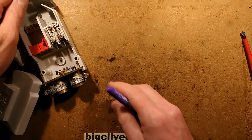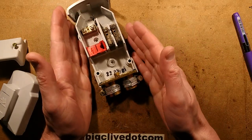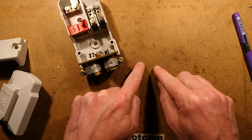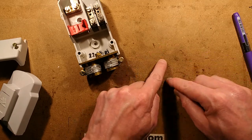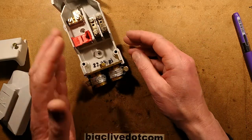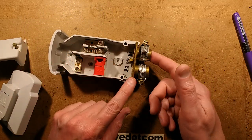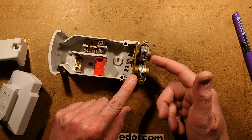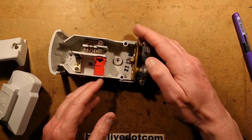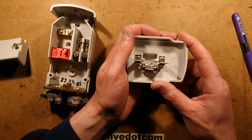As you can see, if you're used to working in factories with standard armour glands — I used to make off hundreds of those, with a refrigeration control panel you'd have rows of glands staggered in zigzags, having to place frying pan washers and draw around them just to fit as many as possible — then you'll suddenly realise these would be so much nicer. They're not as pretty as a proper armour gland with the rubber boot that goes over it, but they're very functional, and in the case of a lamppost, it just makes termination so easy.